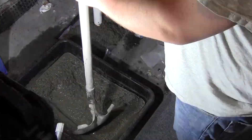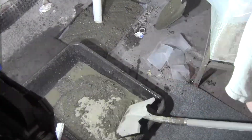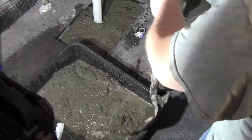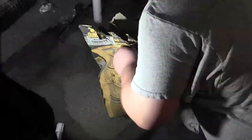And on to throwing the concrete into the hole. That was the first bag and I realized I needed a little bit more, so I'm mixing up about a half a bag of additional concrete. This one got a little too wet, so we're adding a little bit more in there to stiffen it up.